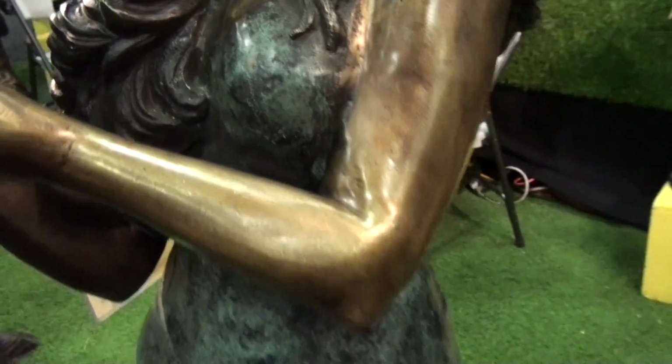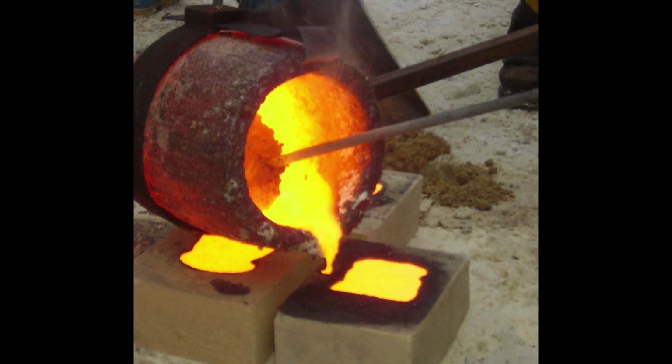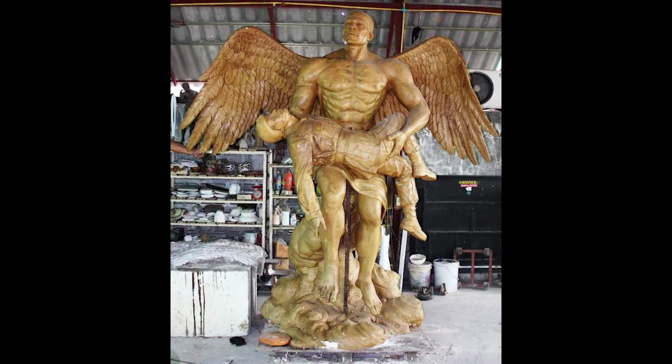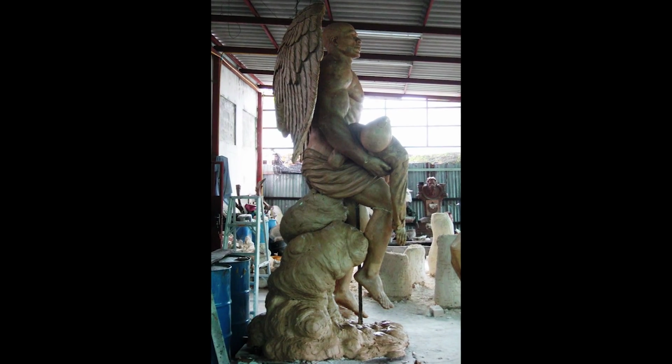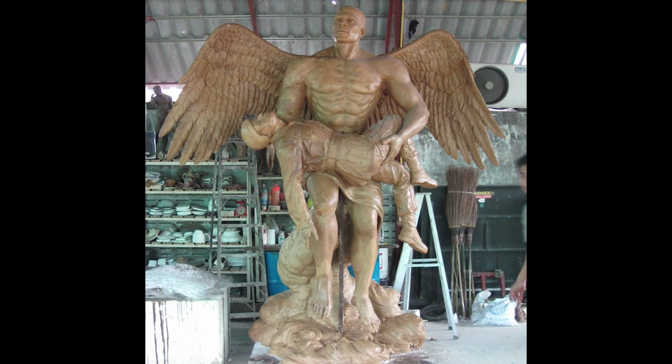Bronze is an alloy. It is a mixture of about 85% copper plus small amounts of tin, zinc, and silicon. We've broken down the casting process into some basic steps. Copies of the original model are either positives, which are duplicates of the model that look just like the model itself, or negatives, molds of the model that fit the model, like a glove on your hand.